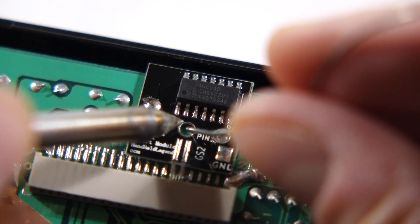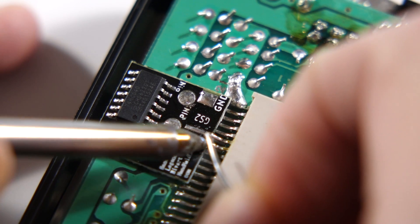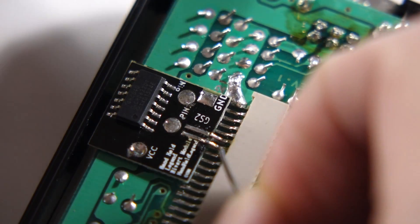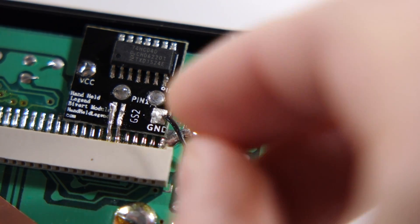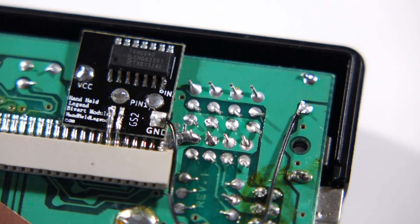This will get most of the solder, but a small amount is bound to get left under the pins themselves, so use a craft knife to carefully lift each pin while applying some heat. Bend both pins upwards a bit and go ahead and set the module into place. All you have to do is heat up each connection and feed some solder into it. Then bridge the connections between the two long surface pads and the pins we lifted earlier. All that's left is to solder the included wire to the ground pad on the module, and the other end to the corresponding point on the logic board.